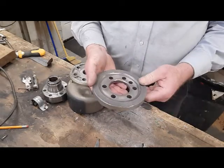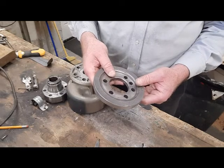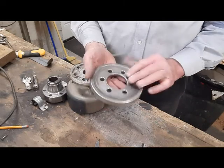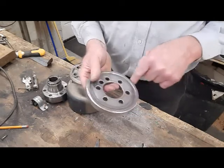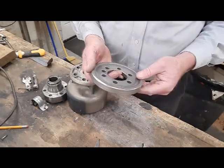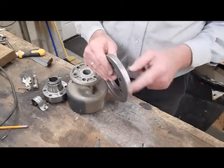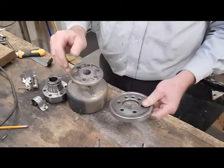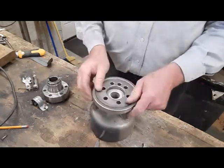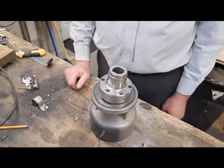That is the center out of the V6 50-pound flywheel. We drilled a million little holes here and cut the center out, and then used a grinding wheel to smooth that, beveled the edges, cleaned it up. So that goes to there, that goes to there, and we are coupled.